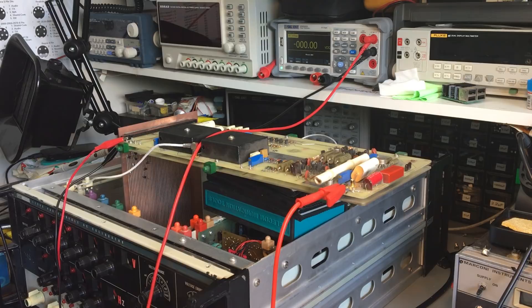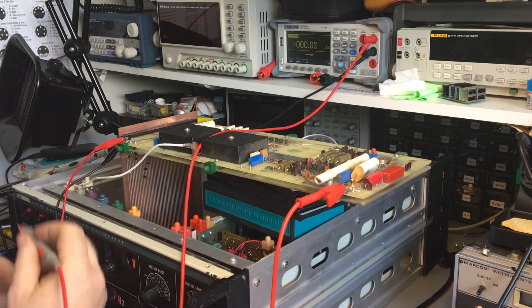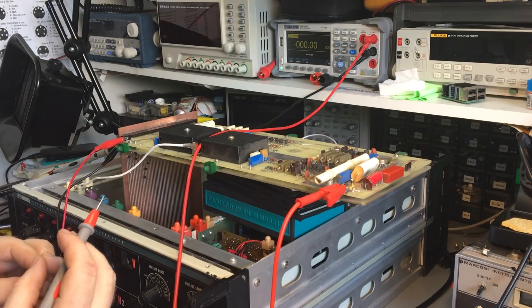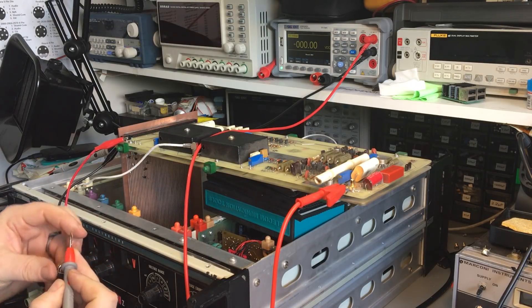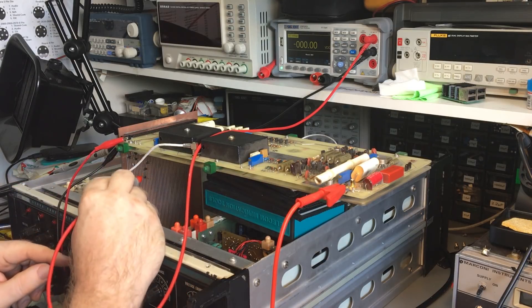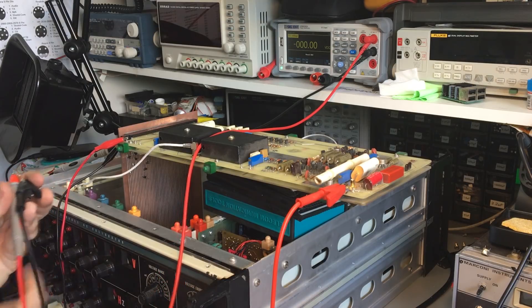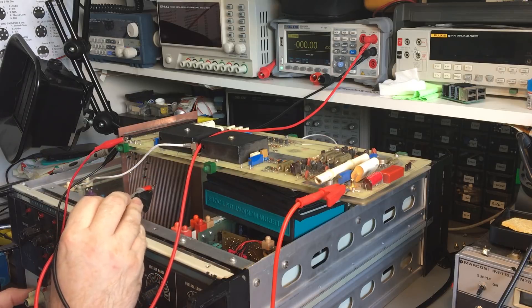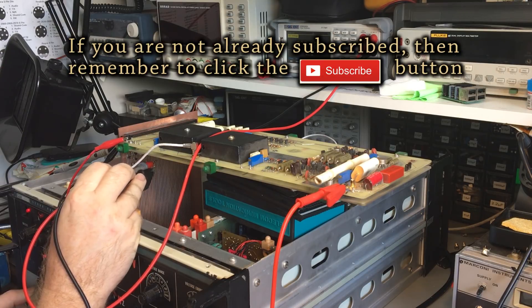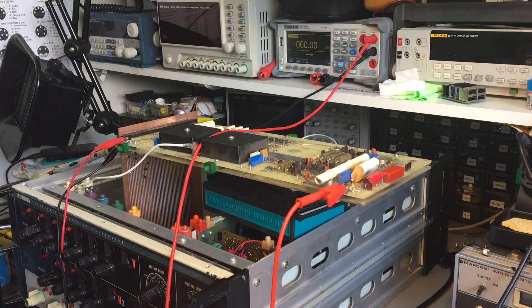The next step wants me to check each pin under load. I've pre-prepared a load — a 270 ohm resistor on the probe, the same setup used for the master and new reference assembly checks. I'll probe pins 67, 61, and 65 with the load applied. Pin 67: still fine. 20 volts: still fine. Minus 15 volts: still fine. They can handle the 270 ohm load with no problem.